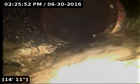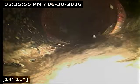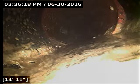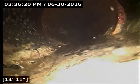We're back in the Orangeburg section here. At this point, given the age of the line, luckily the terracotta section is working. My concern is the future of the line and those joints. They all basically look to be compromised at this point. It's a miracle that roots haven't come through any of the joints at this point. Either way, many of them look like they may be allowing water to seep out. There's a couple joints that are open to the ground that's visible. And then you have the joint with the worms coming through that's obviously opened up to the ground. So because of that, I recommend updating the sewer line from the cleanout out to the main lateral. At the very least, get this Orangeburg section updated.